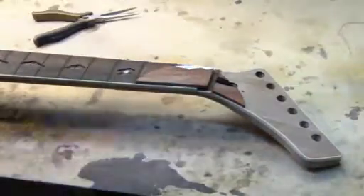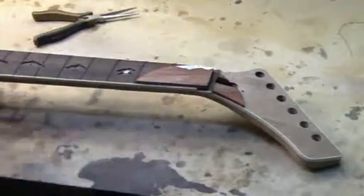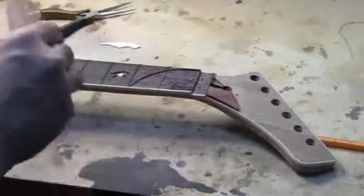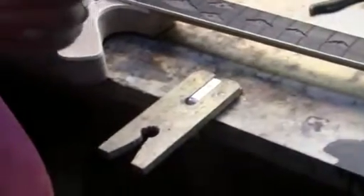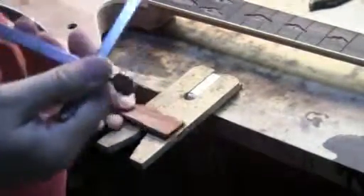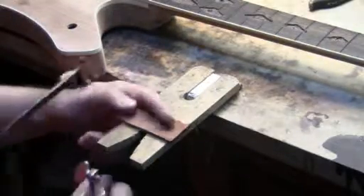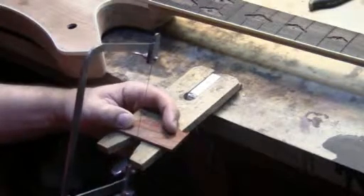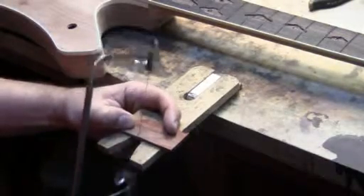So that's what we're going to be working on next, and then we're going to cut out the pieces, glue the pieces in the fretboard, and radius it back to 12 — which is what we found out that was. I don't want a very big gap, so I'm going to use this little thing called a V-block, which is a real friend of the inlay artist. I'm just going to come in here with a very thin blade and cut that line as accurately as possible.